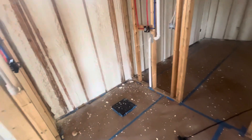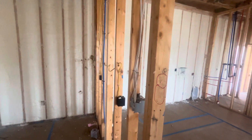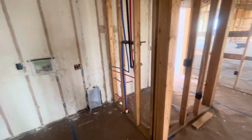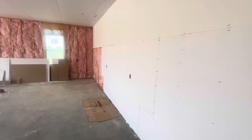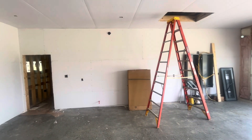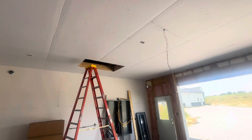Of course you'll have the big four by six shower here. All of this is foamed — we foamed all walls that back up to the garage, and all walls on the garage side are considered firewall. We had to drywall the garage in order for them to go ahead and foam it, and they foamed the garage ceiling as well.